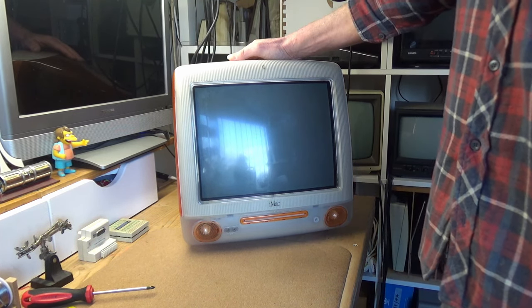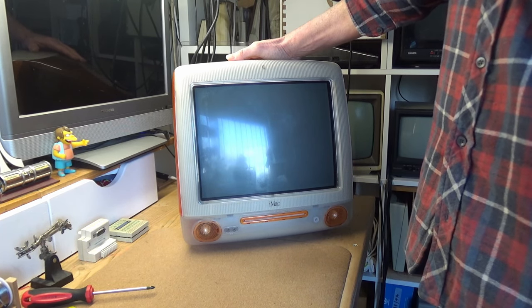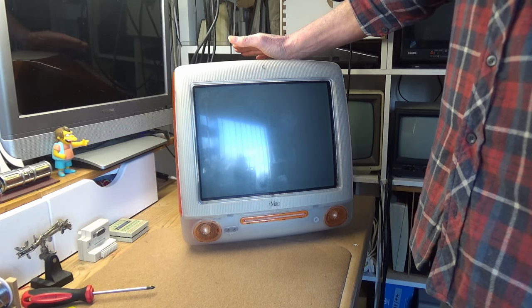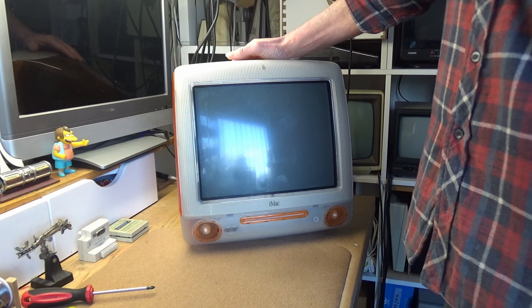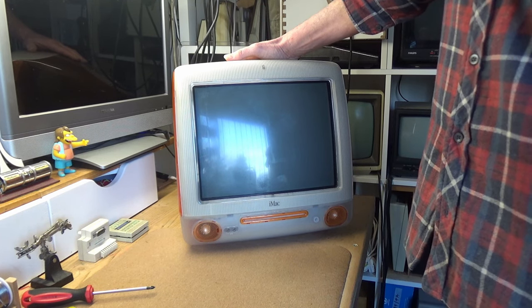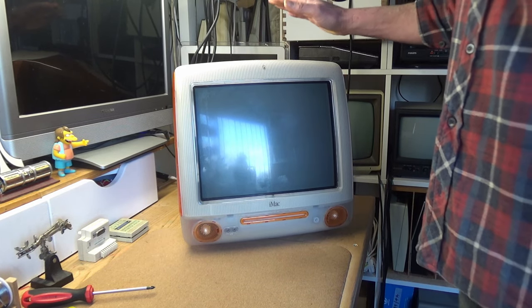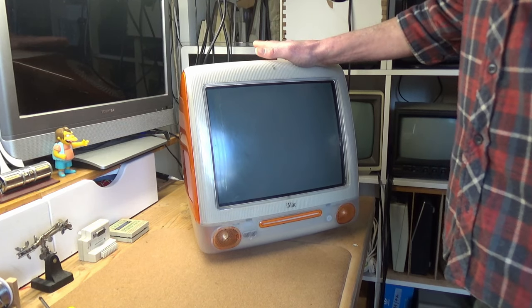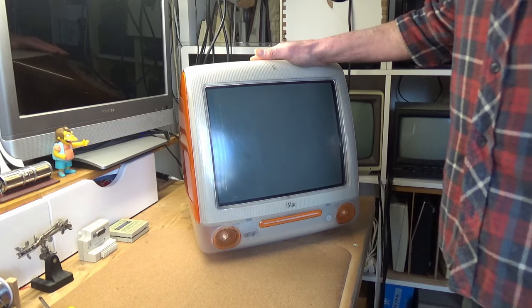Fortunately, the service manual is readily available online, and there are a number of tests and suggestions to help bring it back to life, or at the very least, narrow down the problem. And given that this is Marchintosh, what better time to try to see if I can revive this beautiful computer? So follow along with me and let's see if Apple's own technical docs can revive this lovely G3. The first thing to do is to turn it upside down, open it up and replace the battery, followed by resetting the PMU chip.